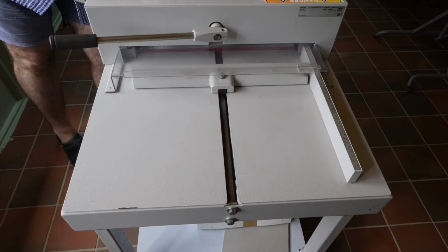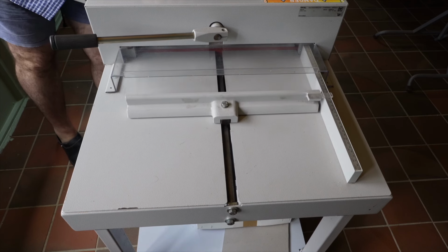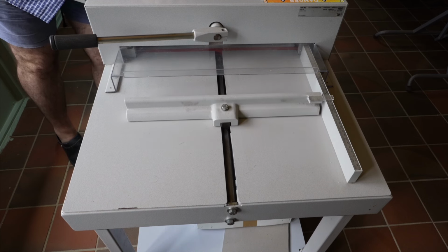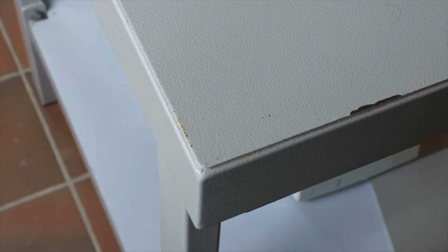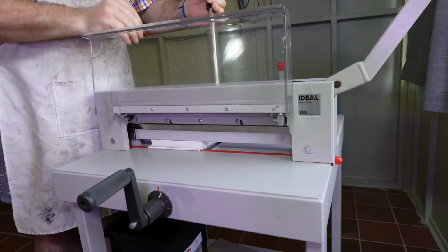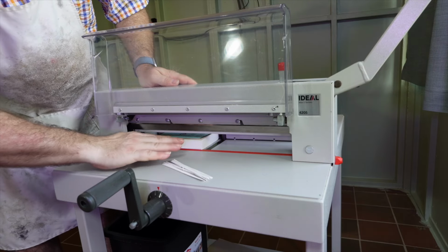You should expect any second-hand guillotine to have a dull blade. The blades are also called knives. You shouldn't try and sharpen a guillotine blade yourself. It's far too dangerous, and the steel is extremely hard. It needs to be ground at a professional facility that deals with large commercial knives or blades and saws. Not by the bloke that overgrinds your kitchen knife or hair scissors.